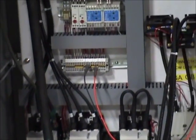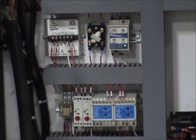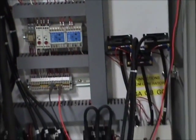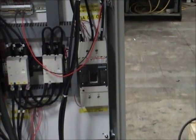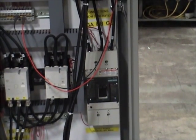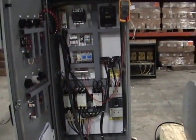In the middle of the panel, we have three separate protective relays. One is used to protect the generator from over voltage, while the other two are used to protect the motor from improper phasing and over current respectively. On the right, you can see where the 400 Hz power that is produced by the generator is brought into the enclosure and terminated on our 400 Hz output circuit breaker. To run this system, you simply need to shut the input and output circuit breakers and push the start button. Once this occurs, the motor generator set will ramp up to speed and in approximately 10 seconds, it will produce the 400 Hz power required.